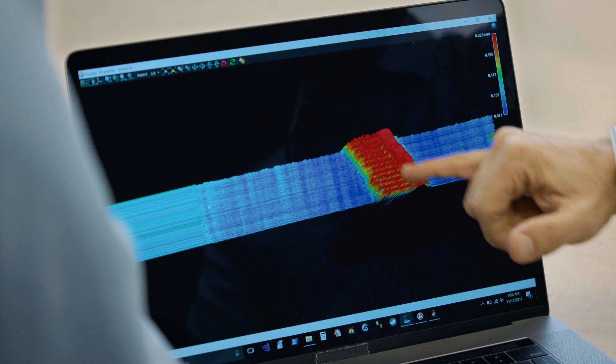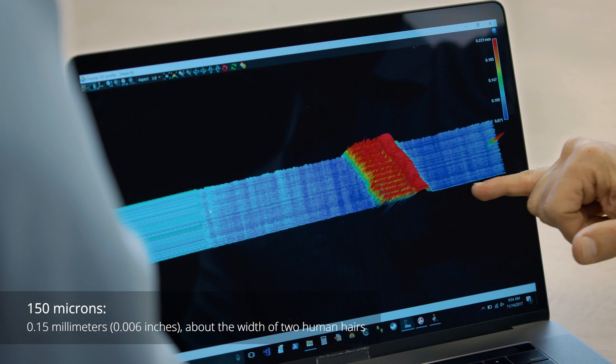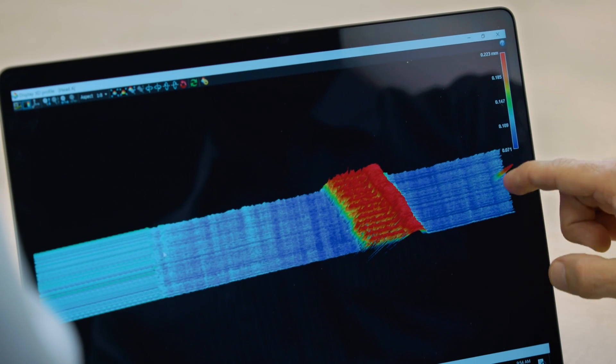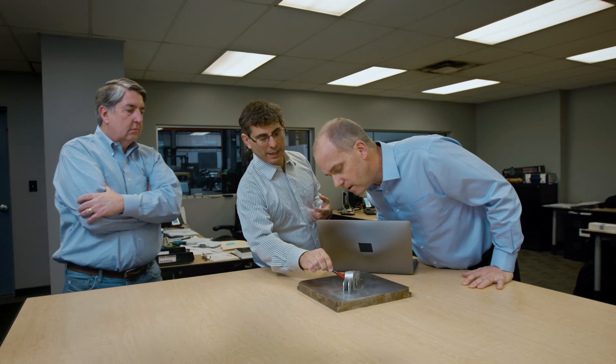This layer, if you look at the color mapping here on the right, it's only about 150 microns tall. What we're trying to determine is whether everything looks good — are there any spots that are missing, any extra? You can see right out here to the right, there's this strange little anomaly, a little spike that's sticking up. That's not supposed to be there. It could be a little speck, a little piece of metal that washed away a little bit. We know it's not important for us — it's not there on subsequent layers. In general, this is your clue to go look either during the build process to check if it continues to propagate through the part, or maybe something we want to check later during inspection.